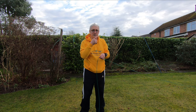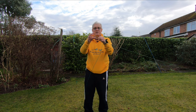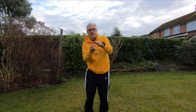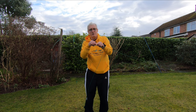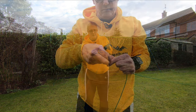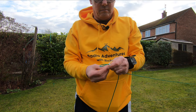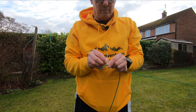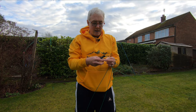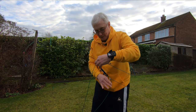We're ready now to start making the feed line, which will go back seven meters. To form the feed point of the antenna at the seven meter mark, I've made a small loop and I'm going to use some cable ties to form a permanent loop into the wire — this will attach to the center insulator. I'm going to use two cable ties to make sure it's nice and firm, pulled tight. I've got both loops formed approximately the same size, so now I'm going to attach the center insulator, which just clips onto the wires to make our center feed point.